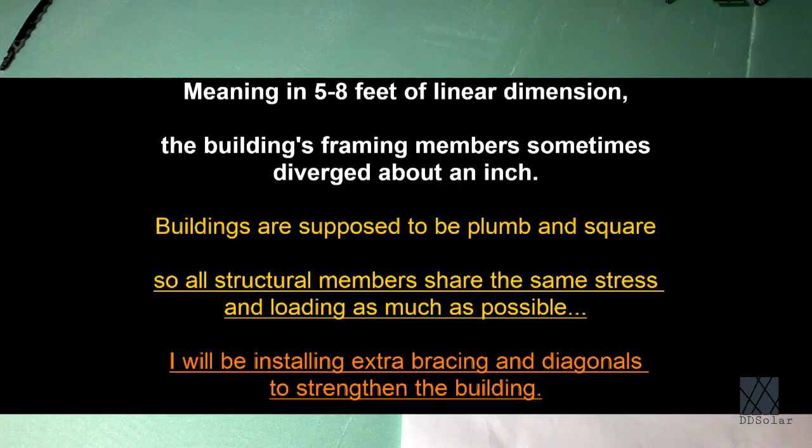I also want to point out that my metal building does not have a single post that is plumb or square. Not a single dimension in any part of it is the same. Not a single template could be used. Every single piece of foam I cut for this building had to be precision cut to fit the two posts in particular that I was placing the insulation in between. I thought I was just going to make a template and copy it 300 times. Boy, was I wrong. In some cases, the dimensions were off by over an inch.